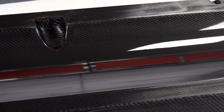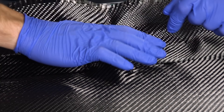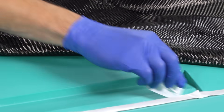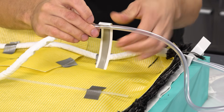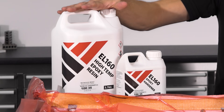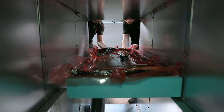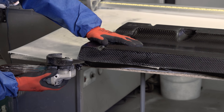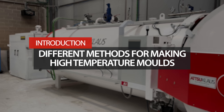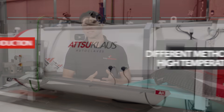In this tutorial I'll talk about the purpose of this type of mould, the type of reinforcement that's needed and how to position this onto the pattern, including a method of making an invisible tackifier. We'll then set up the resin infusion lines and consumables and run the infusion with the EL160 high temperature resin system. Finally, we'll look at the curing and post-curing before trimming and finishing the mould ready for it to go into service.